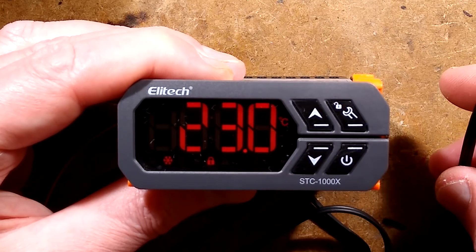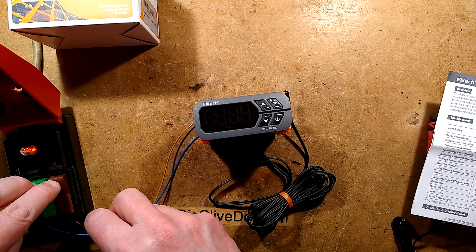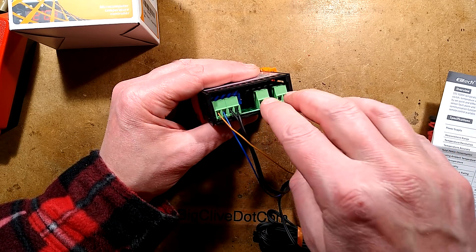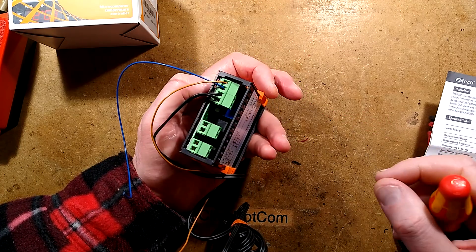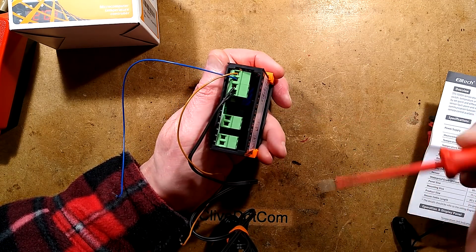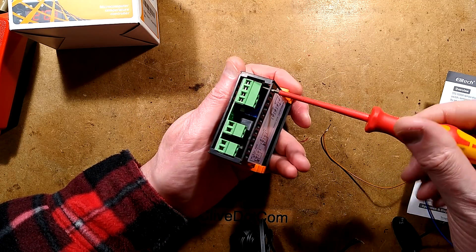Let's take it to bits. I'll zoom back out and adjust the exposure. This is a 240-volt one — well, a 220-volt one; it's not getting smoky and hot on 240. First thing I notice is that there's no cover over the back like some of the other ones do — it's direct connection to terminals. You can put a screwdriver through these plastic holes into the terminals. It's rising clamp terminals — that instantly wins points. That means it's a better quality terminal better suited to technical use, because the cheap nasty terminals that just crush a little metal leaf down with a screw are not very good.